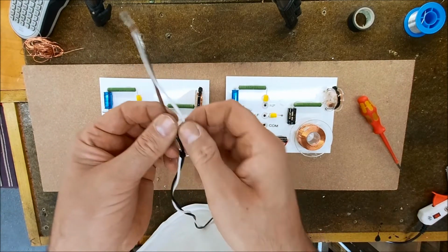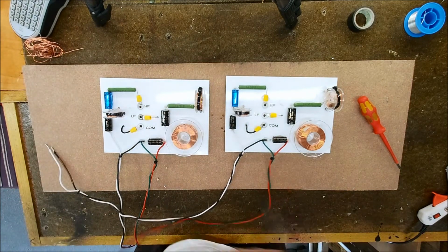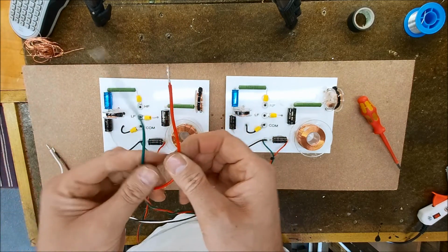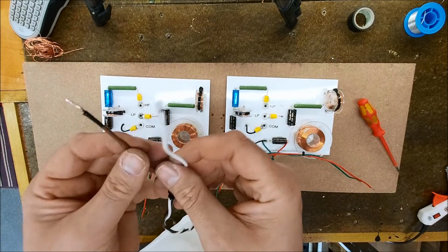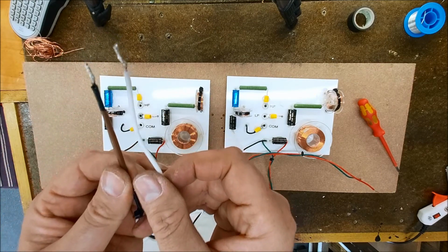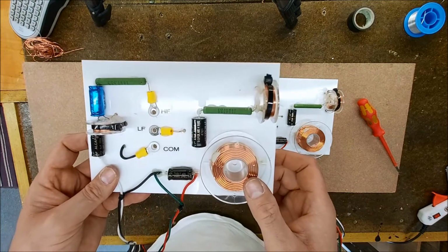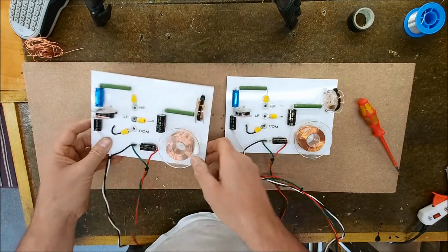And then we've got our cable for the tweeter, color-coded exactly the same. Cable for the woofer, color-coded exactly the same. So originally the cables on the woofer were soldered, so I've tinned these up ready as well. The tweeter had push fit connections, which we don't want, so I've soldered these, tinned these as well. So Jesse will have to solder both of those on, but otherwise that should be a retrofit. Everything's labelled. So there we go, all done.